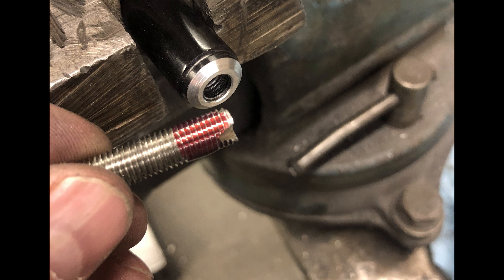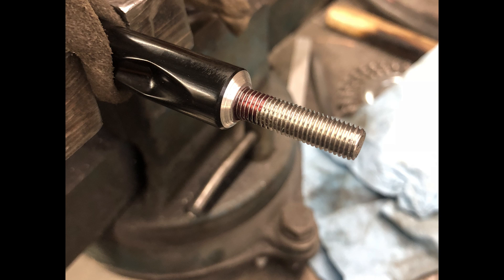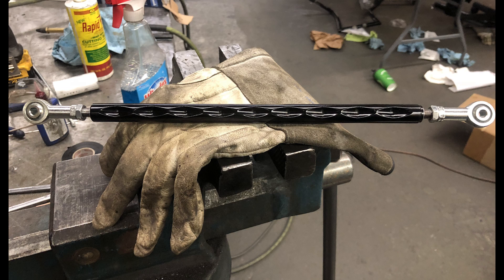On the other side was a left-handed thread, and since we didn't have a left-handed tap, Brandon — smart guy — just cut some flutes into the stainless steel rod. Because we're threading stainless into aluminum it was no problem cutting it in. I actually threaded it in, backed off, threaded it in, backed off, used cutting fluid, and chased my own threads further into the rod, blew out the shavings. Once it was nice and clean, I threw in some red Loctite, threaded it in, and let that set up on both sides, then put the ends back on with the captured heim joints.